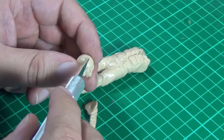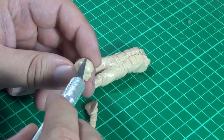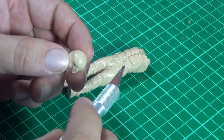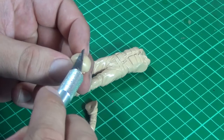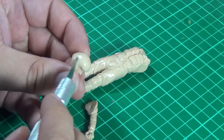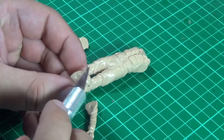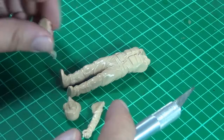Sometimes if you're doing a seam line on a head, it's good to come in from different angles. There was a bit of a spur where it came out from the top of the head, and sometimes it's good to cut that off. Don't cut it flat or you might end up with a flat spot — come at it at maybe a 45 or 35 degree angle, go around the spur cutting until it gets close, then take it off slowly. Then you can scrape along the helmet from different angles on a round surface, just so you don't end up with a flat spot anywhere.